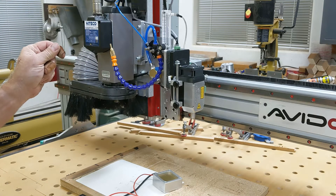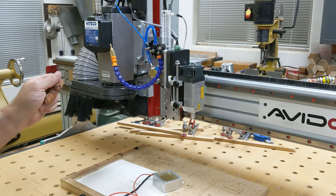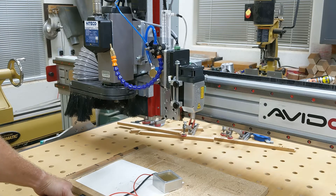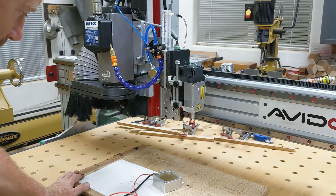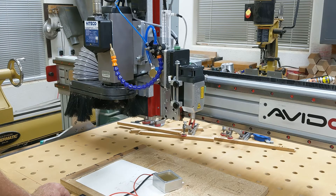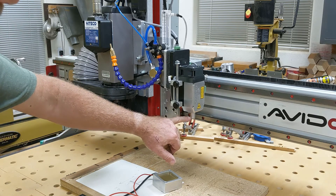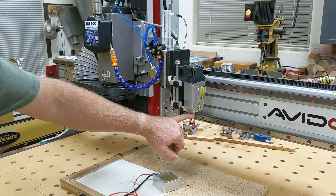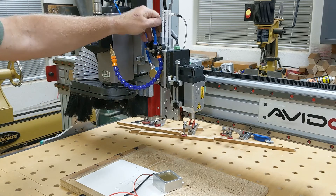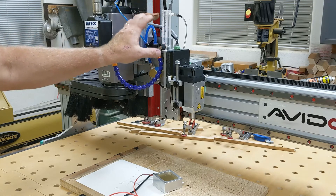The other thing I learned is that with things like paper and wood, you really want very low airflow coming out of the air assist on the laser. Even barely too much airflow starts to blow soot around — especially on white paper, it makes it sooty and dirty. You get the cleanest picture with no airflow at all, but then you don't keep dust and soot out of your lens area, and you definitely don't want that. So I added this flow meter which goes down to a couple liters a minute, so I can really dial this in now.